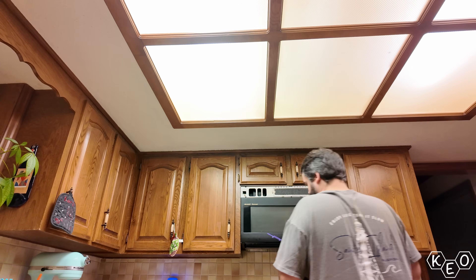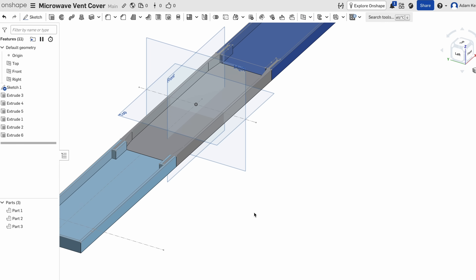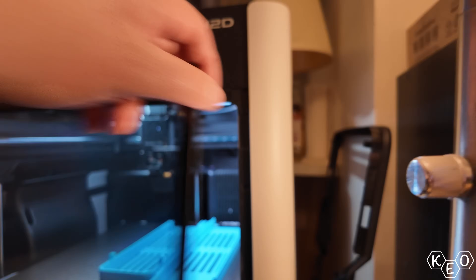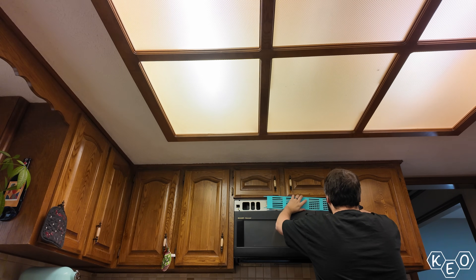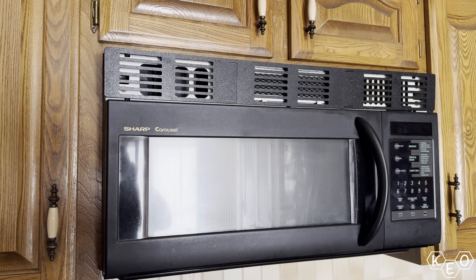The testers printed well, the dimensions were correct, and it was time to fine-tune the model. I moved to a new sketch at the correct scale and created a more refined part. I broke it into three pieces to make it printable and made sure everything mated up well. The parts fit together with a super simple tongue and groove setup, so I left a bit of space at the mating areas to allow room for error. After printing a couple of pieces to test the hook tab fitment and tongue-and-groove fitment, I adjusted the model slightly, and we've got a finished piece that completes my microwave using the power of 3D scanning.